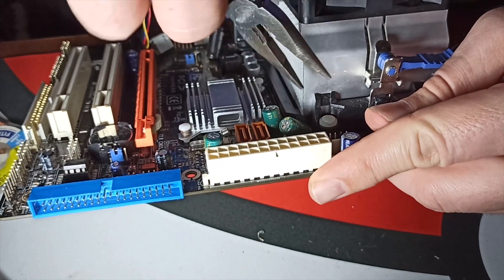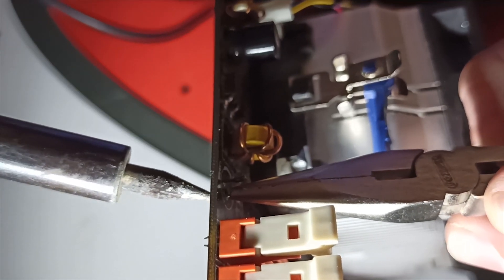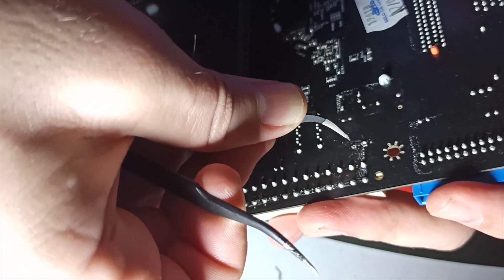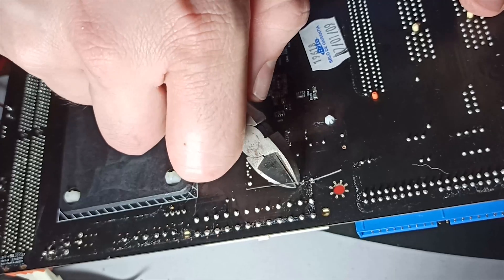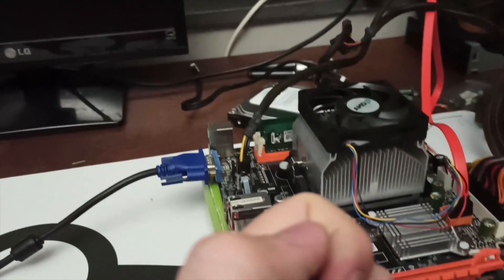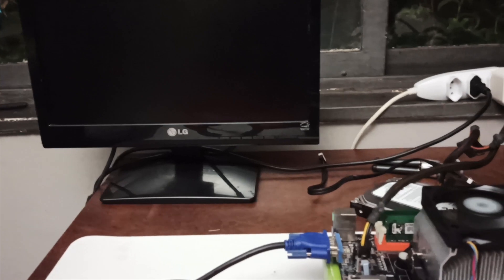And these were the real steps I figured out while doing it. Step 1 — grab the capacitor body with a pair of pliers and rip it apart so only the legs are stuck to the PCB. Step 2 — use a pair of pliers to yank on the leg on one side of the PCB while you push with the tip of the soldering iron as hard as you can on the other side. Step 3 — after you remove the old capacitor, get something thin to push through the hole and make it wider; I ruined a pair of nice tweezers to do this, but maybe you can find something else. Step 4 — now you'll have enough room to stick the new capacitor's legs in. Step 5 — don't be shy with the amount of solder wire you use, and after melting it in place, pull the soldering iron out to make the molten solder look like a raindrop. Step 6 — hope for the best that your board doesn't have another busted component and that in this process you didn't ruin anything else on it. I surely thought I did, and in the end, maybe like me, you'll learn that no matter how many YouTube videos you watch, you really only ever learn something by doing it yourself.